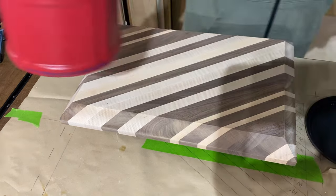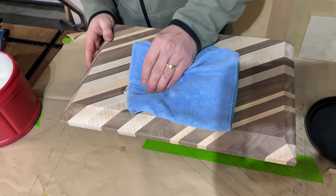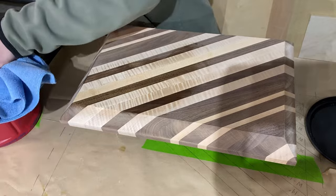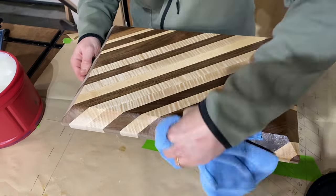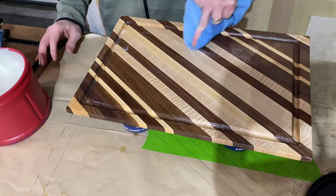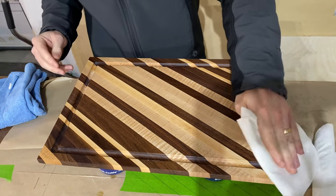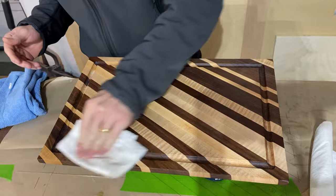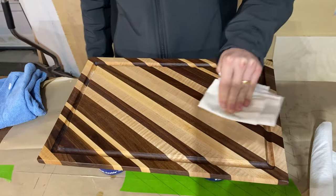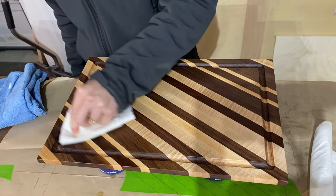The best part of the final project is putting the finish on. I've got my finishing cones and bench cookies so the finish doesn't sit on the rubber grips. The finish I use is one I made up myself — a very simple recipe: just mineral oil and beeswax. I don't dunk my boards or anything like that; I just apply a liberal amount of finish and buff it on. Once it's had plenty of time to set into the wood, you buff it out and take off all the extra sitting on top. It may still feel a little oily for a few days; let it rest before delivering it and that'll help as the wood finishes absorbing it and the leftover wax hardens and seals the board.